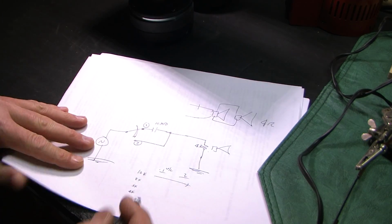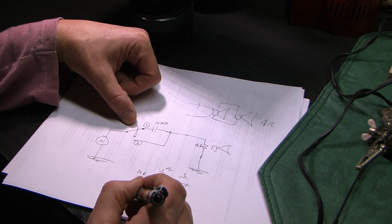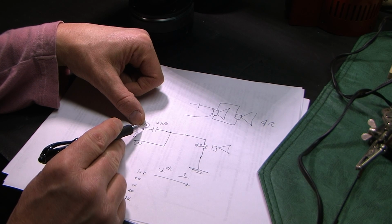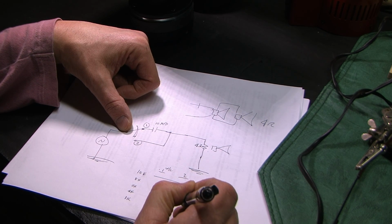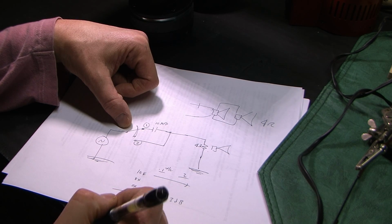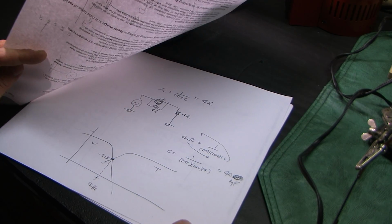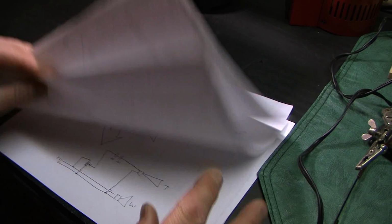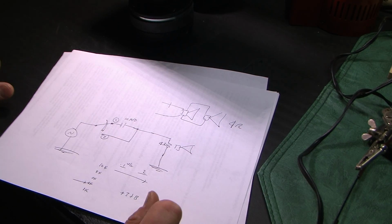So that's how I'm going to verify. When I get down to 4K, I'm going to hope that when I go from position 1 to position 2, I have a plus 3 dB gain in acoustic output at 4K. Is that what I designed my... yeah. I'm already forgetting. Yes, I designed it for 4K. Sorry. So that's the test. That's the test mechanism for this.